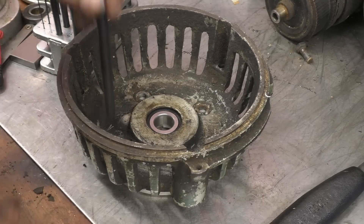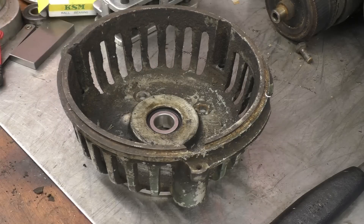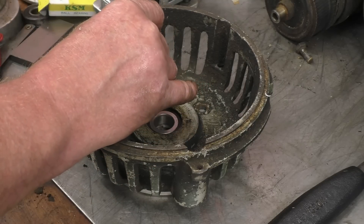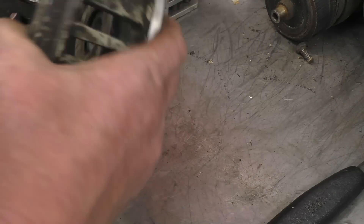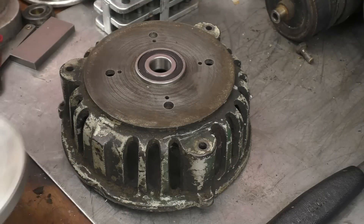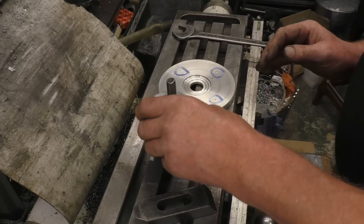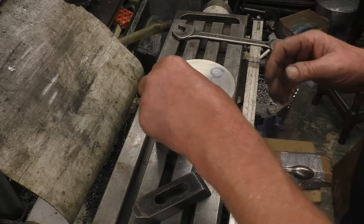8.5, so that's like five-sixteenths. I'm going to mark this — it should go anywhere — the holes appear to be symmetrical, but we've got the four pop marks there so we can go ahead and drill them. We need to pick up those hole centers. It's just a simple bit of tube with this machine that traces parallel to the bearing tracks — does exactly the same job.